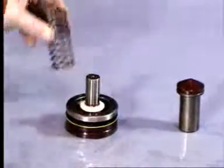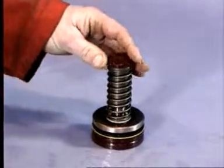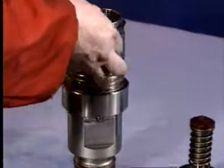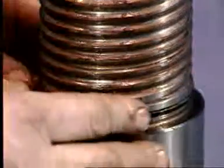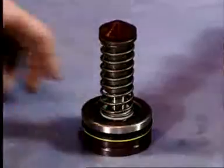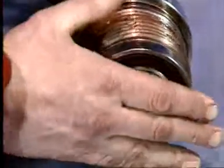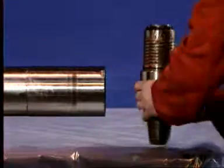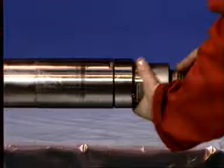Place the non-return valve onto the makeup unit. Fit the O-ring onto the top adapter, depending on hammer model, and grease the lower threads of the top adapter. After greasing, slide the makeup and non-return valve assemblies into the lower end of the top adapter. Screw the top adapter with its O-ring, if fitted, into the cylinder and tighten fully.